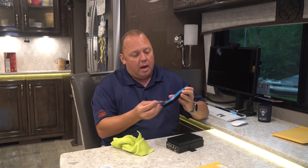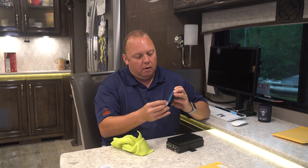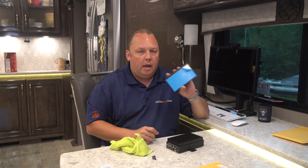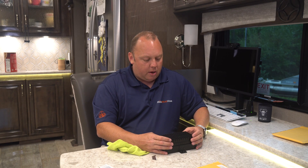On the back of the heatsink we've installed some thermal conductive tape — double-sided tape specifically designed to conduct heat and transfer it from the device to the heatsink. I've already installed one here so I can't show a live demonstration, but it's pretty simple. I typically use a razor blade to remove the blue tape on top of the thermal tape, which exposes the white thermal tape below. That's ready to stick directly onto your device. Position it centered as you see here, push it down firmly from center out to the device.